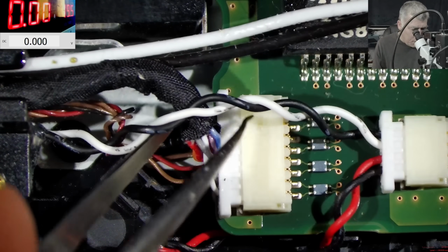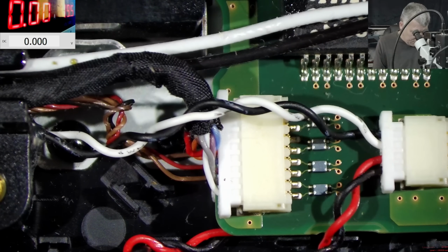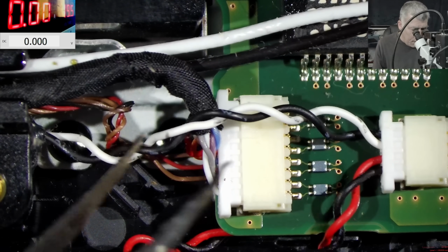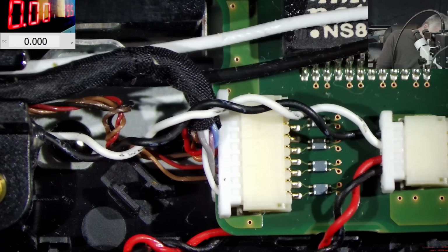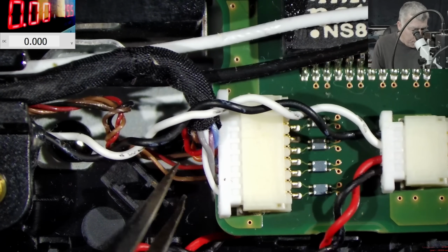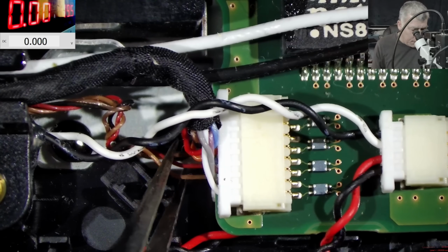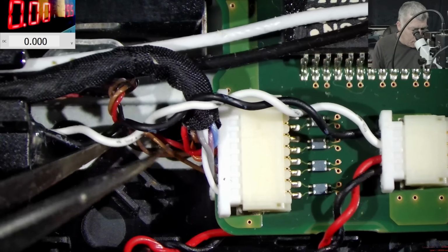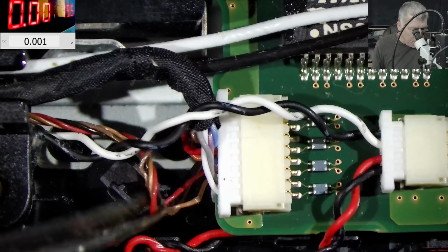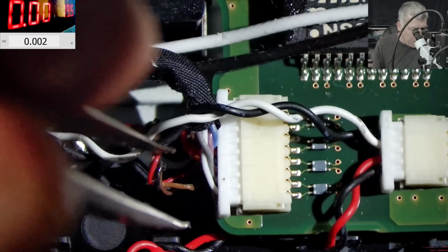Okay, and you will say, sorry, let's test your theory. This is the LAN connector. Okay. So testing my theory is very easy to be tested. Just assuming we have a stuck power button, if we are unplugging this connector, let's unplug it. And we reset the BIOS again, the laptop should come on without shutting down, and we should have picture also, right?